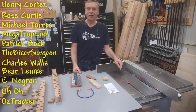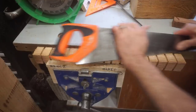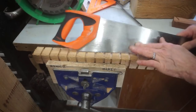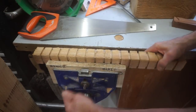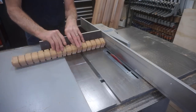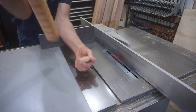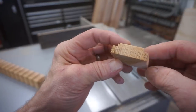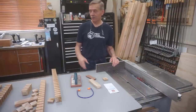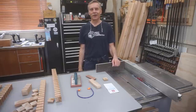And here's a little tidbit for dedicated end-of-video viewers: to replicate the rough texture on some of the square pyramid caps I decided to pre-texture them in the vise using the sharp big-box handsaw technique featured at the end of the mission impossible long holes video. A few quick licks with that handsaw removes the smooth planed surface on the sides of the blanks and gives some interest with aged, weathered texture to the sharp corners — so these pyramid caps come out with a unique texture all their own. Thanks for sticking around to the end of the end.